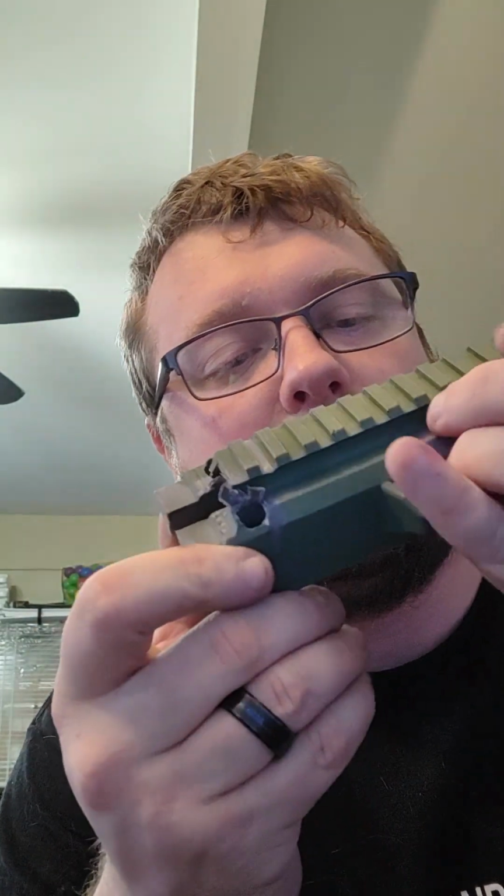Otherwise, this upper is in pretty good shape. One noted failure. All right, I don't know where those parts are. Anyway, one noted failure is the charging handle latch. There was a small nub printed into the upper that it was supposed to interface with. Right at the end of printing, whenever I called the test, that little latch failed. So as I have the rifle up, bam, bolt carrier comes back, and the charging handle was no longer locking in, so it actually popped me in the nose twice. Had to do it twice, make sure I learned the correct lesson from my mistake.